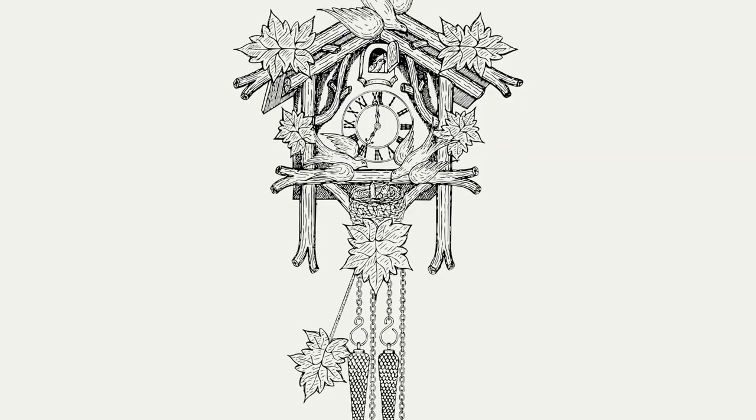First things first is to get an idea. I've always liked cuckoo clocks — it's fairly old-fashioned. I thought about how I could put my own spin on a cuckoo clock. It's obviously got the clock part, the cuckoo that comes out, and the chime on the hour. So how can I digitalize this? Instead of analog hands, the easiest way is a display of seven-segment displays — four of those give the time digitally. For the chirps, I can make that digital by doing beeps with a little buzzer for the number of hours on the hour.